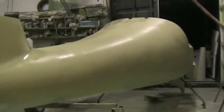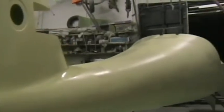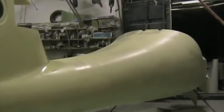I've now completed the sanding of the fuselage joints and I've applied a layer of filler spray. I've used a high quality automotive 2-pack filler spray and the whole aeroplane has been thoroughly roughened using sandpaper on a long block, and as before keeping the axis of the sanding block in line with the aircraft axis at all times. Now that the filler spray is on, minor imperfections are easier to see and these can be filled.